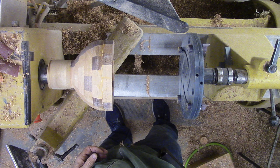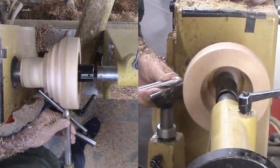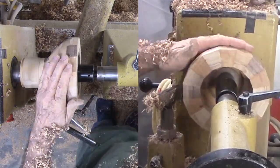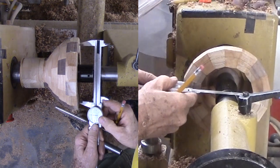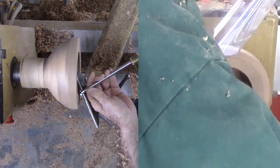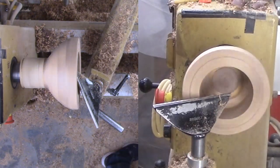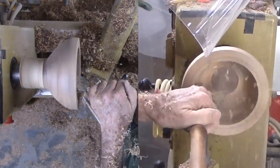With each additional ring, I cut back the ring height according to my plan. If I kept ring heights consistent, the rings would appear larger and larger as the eye moves up the sphere to the pole. With the rings together, I can cut back the exterior following my plan, but not too much since the interior plus wall thickness will actually determine the exterior later. If you have never turned a segmented piece, you are missing out — turning segmented is like turning all side grain without the interruption of end grain like in a solid bowl.